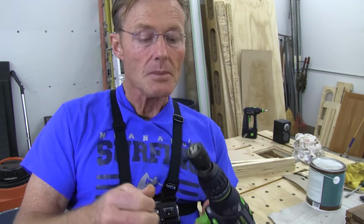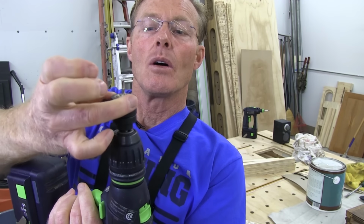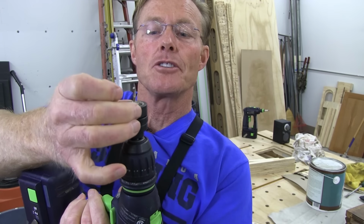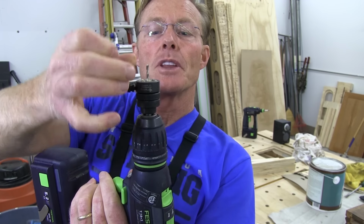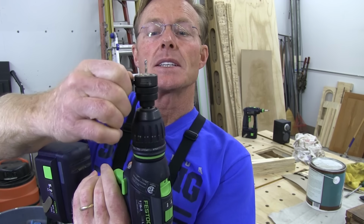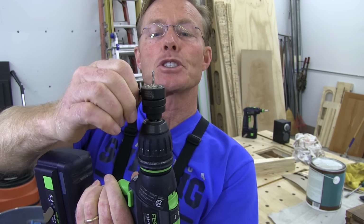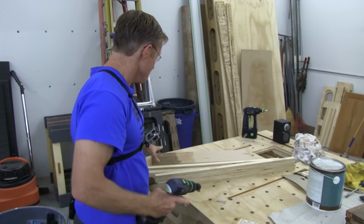And the drill bit has a wide stop, basically, that spins. And so it's adjustable by loosening this set screw. Then I can spin it up and down to the right thickness, then tighten it down. And then when I drill into the wood, this hits the finished surface and stops spinning, so you don't get any burn mark.